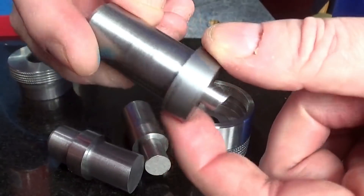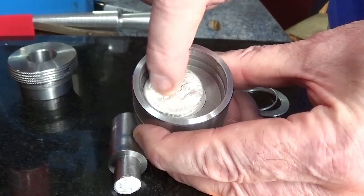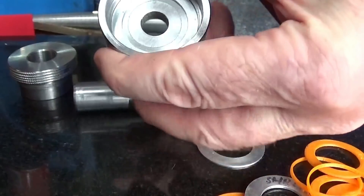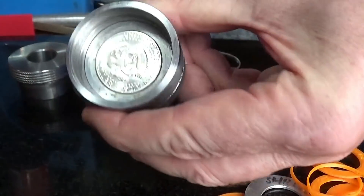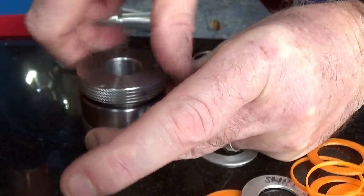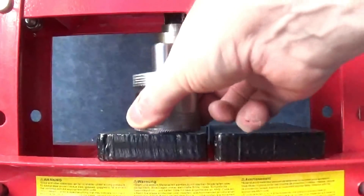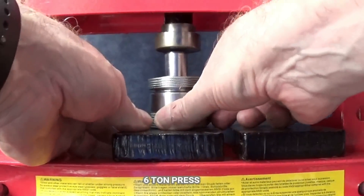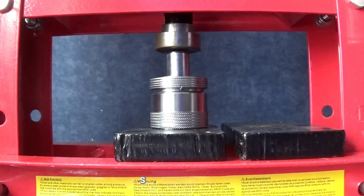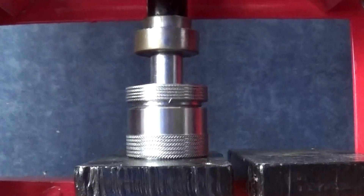This really tiny one is for sixpences and very small coins — maybe up to a shilling. If you put the coin in there's too much slack, so you need a shim. Here's the correct shim: put that in first and now the coin doesn't wobble. Screw it up finger tight, and that goes in there. We'll be using a six-ton press. I've also got a one-ton press but it's not man enough — silver is quite soft, gold is even softer.